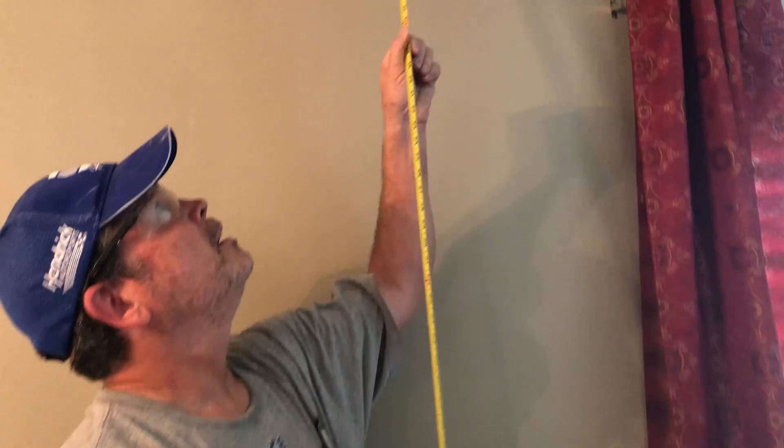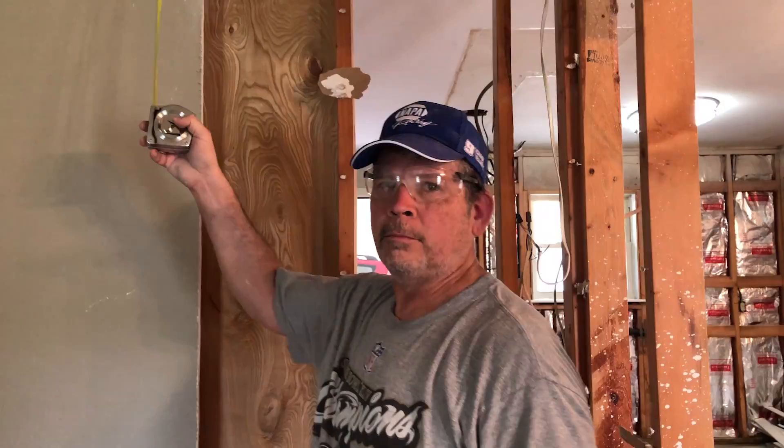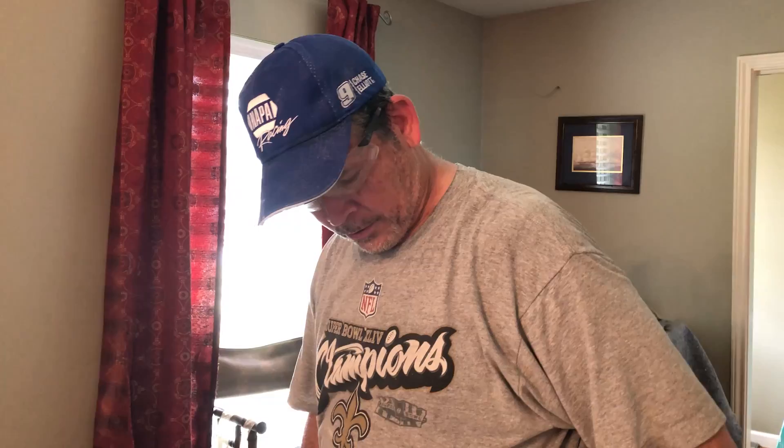We just laid out our top and our bottom plate. But before we show you that, I want to show you up here — you see this ceiling joist? It starts to disappear as we go further this way and we're almost flush with it. That's just the old rough framing. We know our lines are straight because we popped the chalk line — and we're just going to deal with that. We're going to put blocking in here to attach our top plate to.